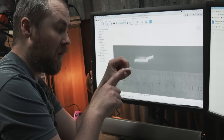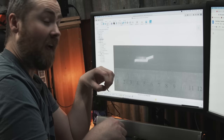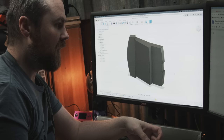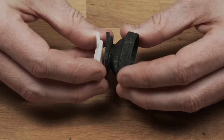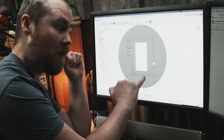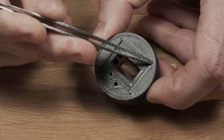Let's design a 3D-printable mount that holds the sensor and make a quick-swap system for the lenses. The first part holds the swivel ball for the sensor in the normal Game Boy Camera, and we're going to use this part for mounting everything on — so it needs to be very exact and very strong. I put this in a flatbed scanner and brought it into Fusion 360, traced it, and extruded the part. After a couple of revisions, it fit really nicely. Next I designed this holder for the sensor — it needed to be a separate part because the sensor mounts on the back and slots into the mount inside the cartridge.